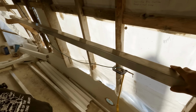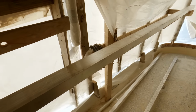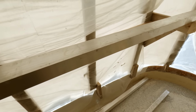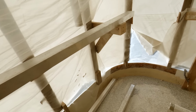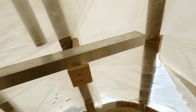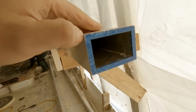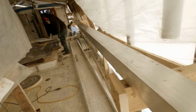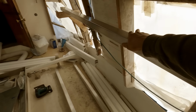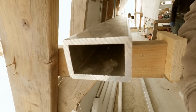We wanted to make this tube with rounded edges, but we were really struggling to get it sourced. We order our metal from Ryerson down in Seattle, and they ship it up to us. And they had been searching for a few weeks and hadn't had any luck in finding some rounded tubing. So we ended up just going with square tube, and we're just taking off 3/16, giving a 3/16 radius. There's plenty of meat right there. So, no worries about it weakening it at all or anything like that. I'll bring you down to the other end and show you. Yeah, still tons of meat on the bone.